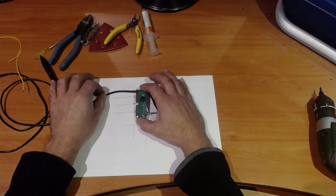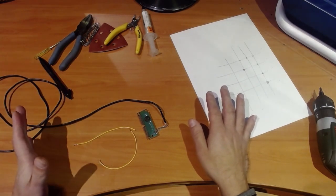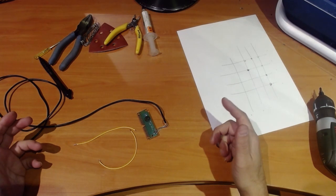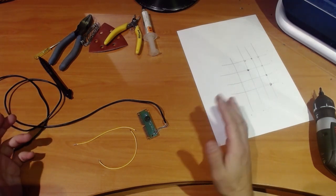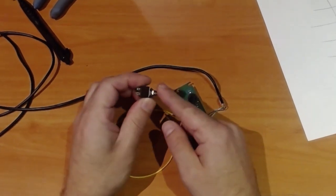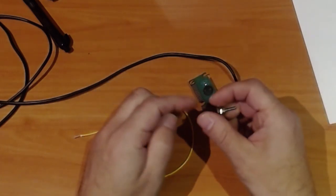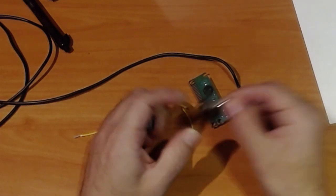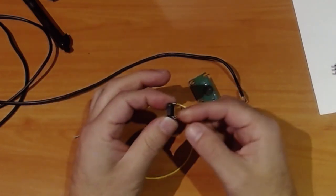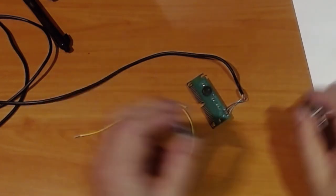It's easy enough to then take this and connect wires directly into a few foot switches or other types of switches — you might want to do a mute, a mute-all, effects on and off, and you can have several switches connected. Be aware it has to be a momentary switch, not a rocker or on/off switch. A momentary switch means when you press it it's on, when you let go it's off. Many guitar pedal switches work well for this — just make sure it's momentary.